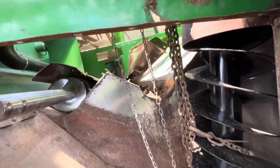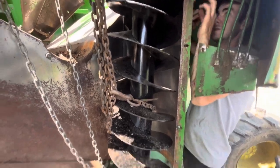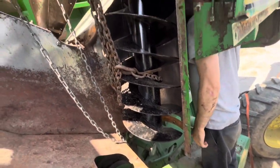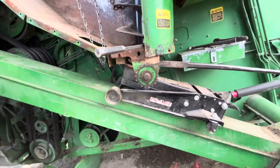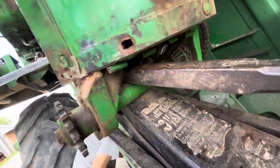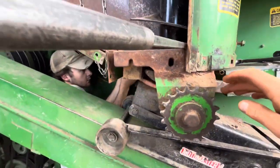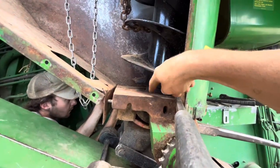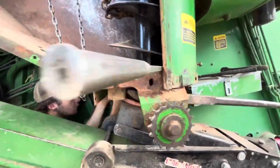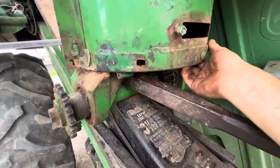Yeah. Okay, so I want to build that. That one's after the plate, so we gotta put that plate into it. Okay, now we're taking the rest. This is where we're at. We got the floor jack underneath, putting this big directional gear piece in. It's really heavy, and you have to line up the splines again, but we managed to do that with some leverage. So now we're just bolting it in.